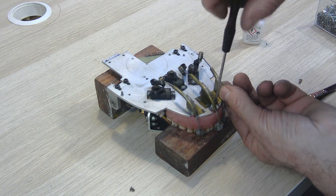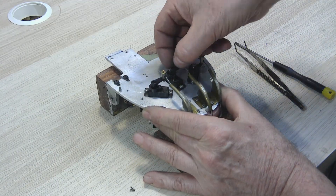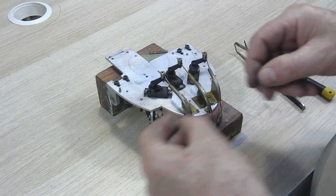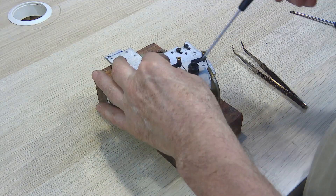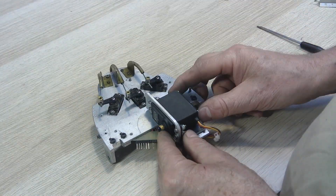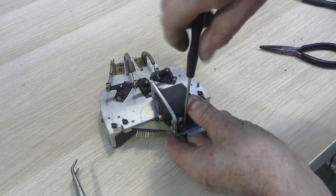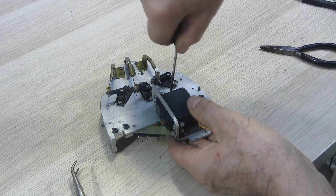I use this type of steel cable because I am able to both pull the lips, but also push them forward, which is very important. This is the mouth motor, and as you can see it is not a micro servo but a standard servo. The opening and closing of the mouth needs more power.